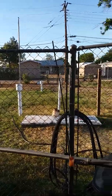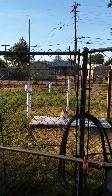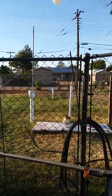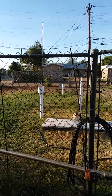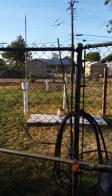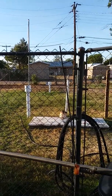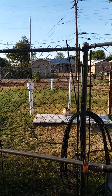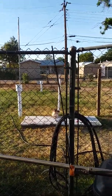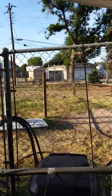Now, when you talk skip, here's the thing. When you're talking long distance, your signal's going up and bouncing off the ionosphere. Funny things happen to polarized signals at that point. They can leave the transmitting station vertical, and they might land at the receiving station several hundred miles away, horizontally polarized. So sometimes they switch and they tumble and turn, and sometimes they can come down being polarized in a different fashion than where they left.